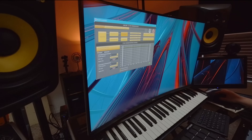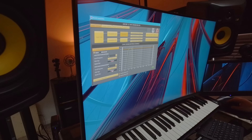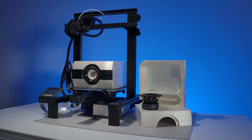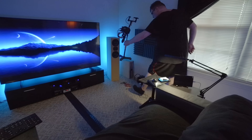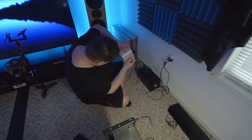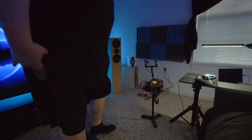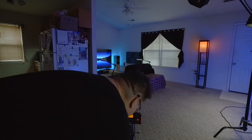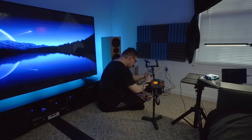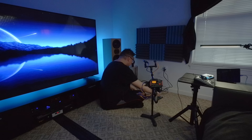So, what I've done here is set up a DSP with a high-pass around 38Hz, everything below 80Hz going to the sub, and everything else being sent to an extended-range speaker you may recall from an earlier video. This, along with some recording gear, is dragged into the living room, where I hope to demonstrate how the enclosure projects across a larger space. The microphones are set up about a meter away for the near-field demo, then about 8 meters away for the mid-field demo, and just to showcase a bit of the organic detail across the timbre, before my regular tracks, here's a few bars of some upright bass.